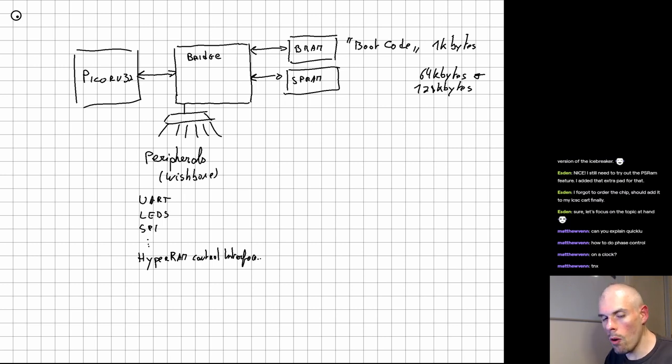And so our own cache we developed, it speaks wishbone, right? But I didn't want to connect it on that bus because it's a slow bus. And so what I did is I modified the bridge to add another wishbone interface which will talk to the cache. And that interface is higher speed.